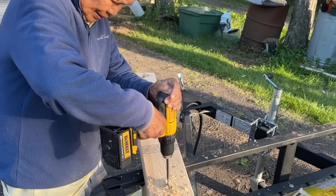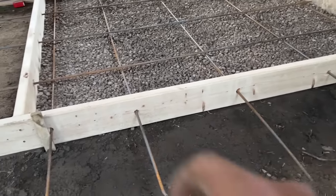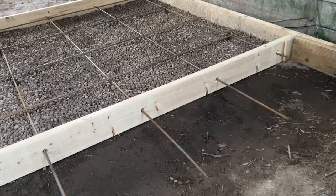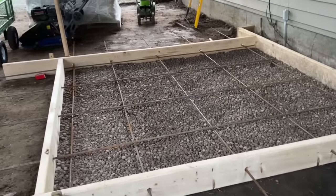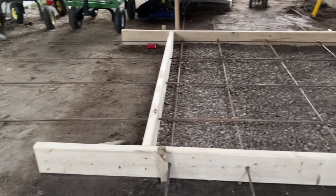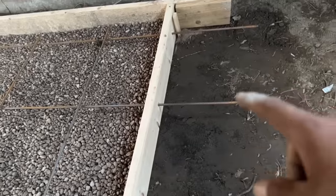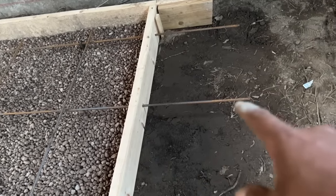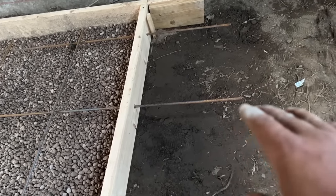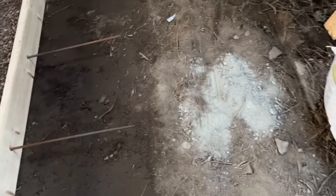With those markings, my dad is drilling one-inch holes. I did not notch underneath the rebar for each hole since there's nothing really in the way — I can just slide the board out. As they get further down I would then need to notch them so I can pop the piece of wood out. For number three rebar, I need to leave at least 18 inches outside — that is the minimum length if you're going to tie the rebar together for the next run.